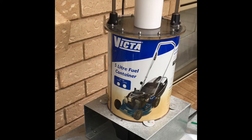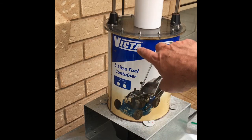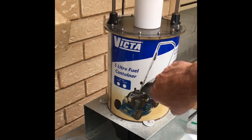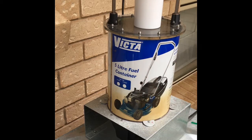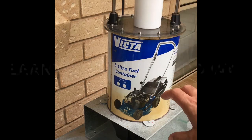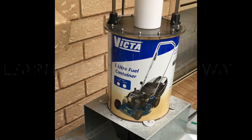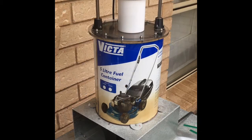What I've done now is I've just raised the board away from the Galden vapors, and now I'm going to give it five minutes for the Galden to evaporate off the hot board and turn back into a liquid, condensing in the bottom of the tin. Because there's such a big temperature differential between the bottom where the vapor is boiling and higher up in the container, the board is actually now in a very cool area — you can touch it, it's not very hot. Just be careful when you do this because when you turn off the light the solder is still molten, so if you just yank it up you are going to upset your components — that component has been bumped off the board because you got a bit excited.